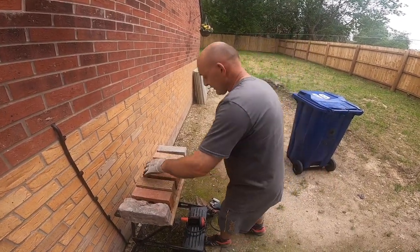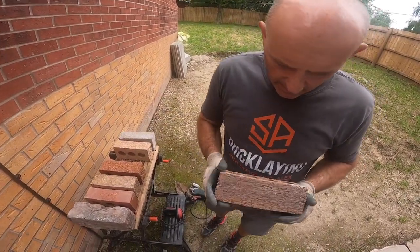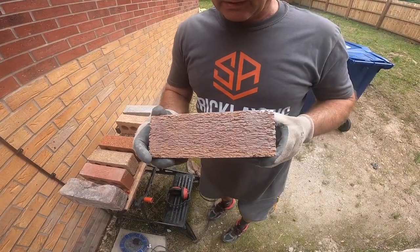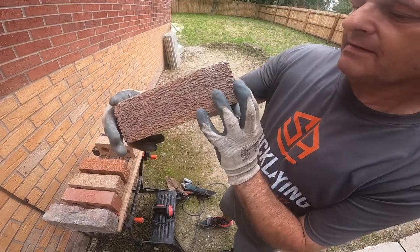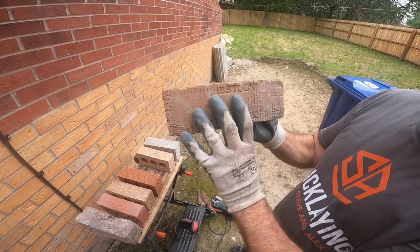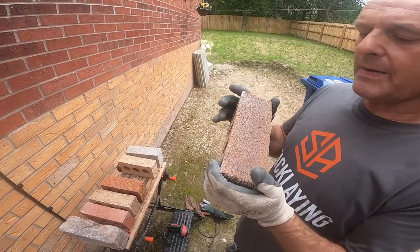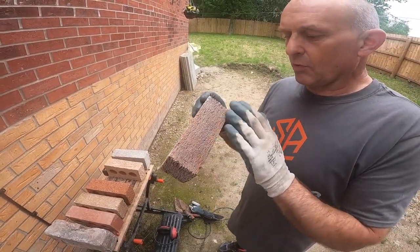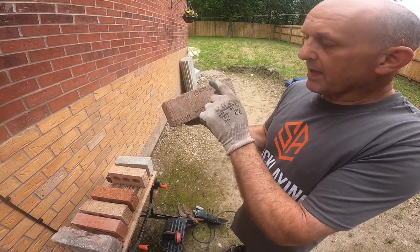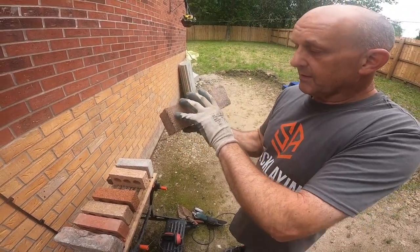Obviously at first when you're looking at them you've got to check first. This one here — I think it's called an Aldridge multi rustic or a Staffordshire multi rustic, they're very similar bricks. With these, when you look on the back they have Ibstock written on them, and Ibstock is printed the right way up. There were also some very similar bricks made in Up Holland years ago called Up Holland rustics, and on the back it was always stamped U-P-H-O-Russ, which is Up Holland rustic — and it was always printed the right way up.